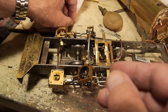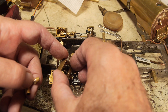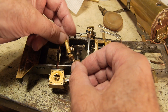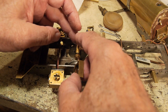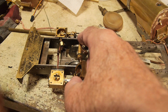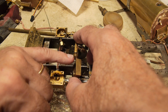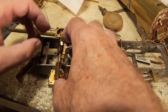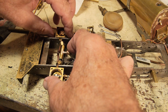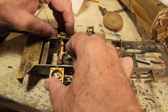Reassembling the pieces I've just been brazing — that's the cross-piece. I pulled the cylinder steam chest back so I can get it on here — it slips on like that. You can see the slide valve there. These are Roundhouse cylinders that have been modified by putting more screws in the end cover. There's an O-ring in the bottom — put a little bit of oil to help the O-ring. I have to be careful not to disturb the timing or positioning of the valve gear because that's all timed up properly.